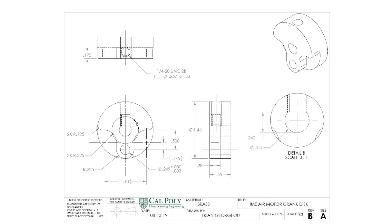Welcome to the Air Motor Manufacturing Project Virtual Spring 2020. In this segment, we're going to produce the crank disc. The first step when manufacturing any product is to look at the engineering drawing. The material the crank disc is made out of is brass, so we're going to start off with some brass bar stock. In order to figure out the diameter of the bar stock, we look at the drawing and see that the largest major diameter on this part is 1.45 inches, so we could start off with one and a half inch round brass bar stock.